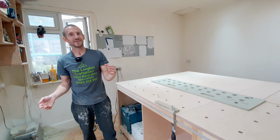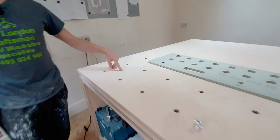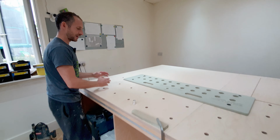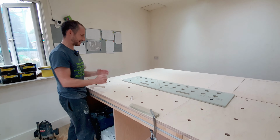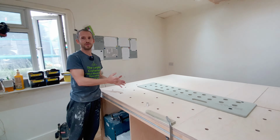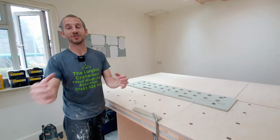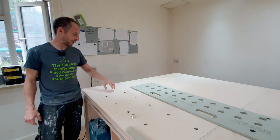You just got to double check, because yesterday I made a little boo-boo, and that wasn't even down to me being strict. That was me just routering one out. I moved it to the side to hoover out the hole, and then I just had a little lapse of concentration, and I just went, oh no. Basically, when you do these holes, you need to plunge it, do an initial hole, take it out, hoover it, and do a second plunge.